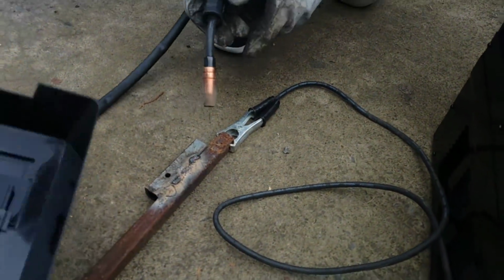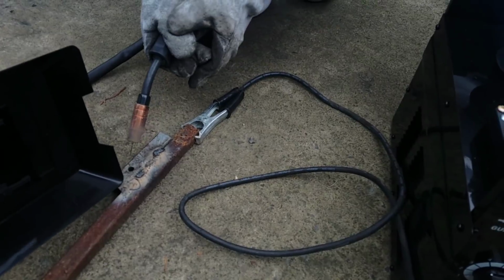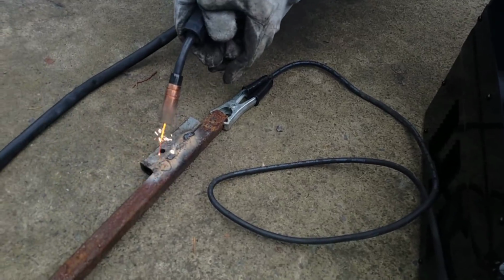All right, melt those two pieces of metal together. Daniel, see how you did right there? You did good there, you did horrible there, you weren't even on the seam. Melt the metal together. If you move too fast, all you get is a bunch of little balls. If you move too slow, you're just putting metal in where it doesn't need to be. Go.